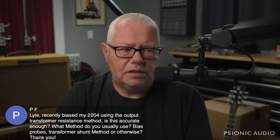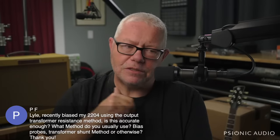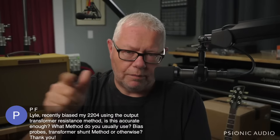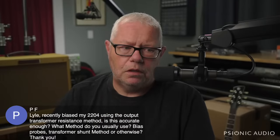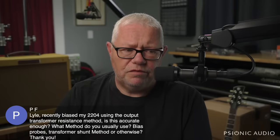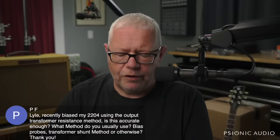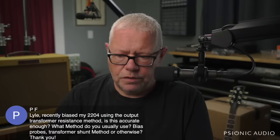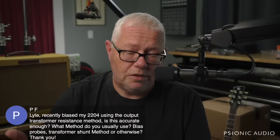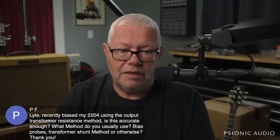Hey, PF. Yeah, I use the transformer resistance method all the time, which is a DCR measurement. In fact, when you see the video on the Victoria tomorrow, I'm going to show you my actual bias figures and you can backwards engineer what I'm doing using the same thing. I don't show the DCR method online very often because it is one of the more dangerous ones to do. It's less invasive than a transformer shunt, but gives you just as accurate results. I'd say it's the most accurate way of measuring bias without modifying the circuit at all. But it is dangerous, and I don't want to put that on YouTube and have someone emulate what they think they saw me do, or not know that if I move this quarter inch, the amp blows up or I electrocute myself. So I try to keep the real dangerous stuff off.